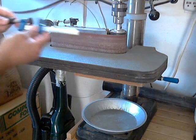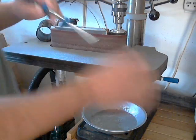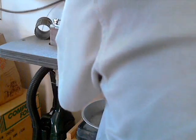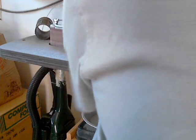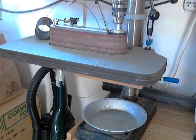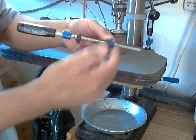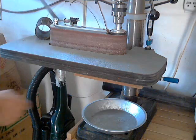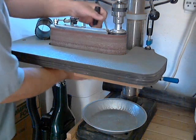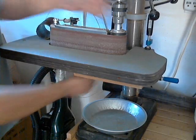Let me pop on a couple of these — these are some six-inch clamps I picked up at Rockler. And on the bottom of that drill press table, I have a couple of pieces of wood epoxied in place underneath, so that the pad will grip underneath on the bottom and they'll both have a flush surface to work off of. So we bolt that down, and it takes only a few seconds.